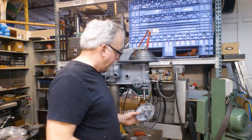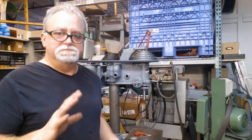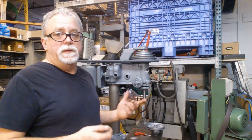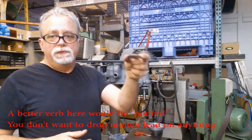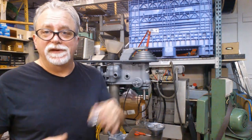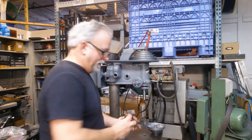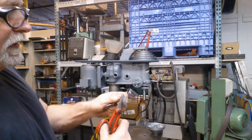So what I ended up doing is I tried to use wheel weights, but they're all steel now or some material with an adhesive backing, which is pretty good, but it's not conformable. They used to use lead. So casting some of my lead hammers, at the end of the cast I wanted a convenient way of putting lead back into my crucible for melting. I just took and dropped the lead with a ladle onto my steel welding table, and I came up with these nice little — I don't know — chocolate chips, I suppose you'd call them. They're only about a little over an eighth of an inch thick, and it's ideal because you can cut them with scissors.